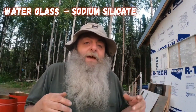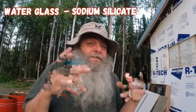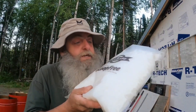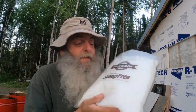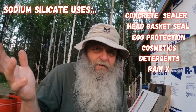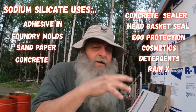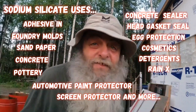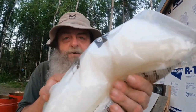To get the super high temperatures we need in this chimney, we're going to add something called water glass. Water glass is basically sodium silicate chemically — it's essentially a liquid form of glass or silica. To make this stuff we start with 100% silica gel, which is actually kitty litter we're using here. This stuff is the same thing used in desiccant packets for keeping stuff dry in food, and it's in a whole bunch of other things too.